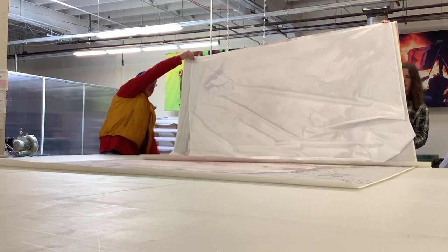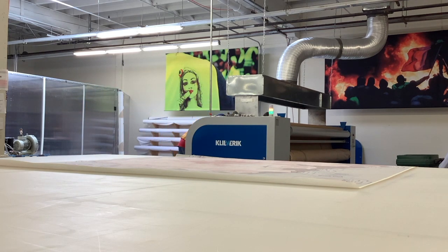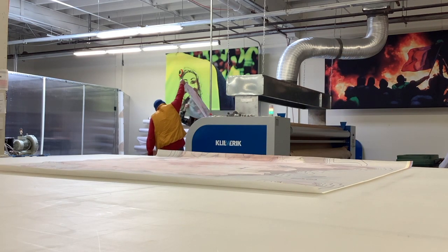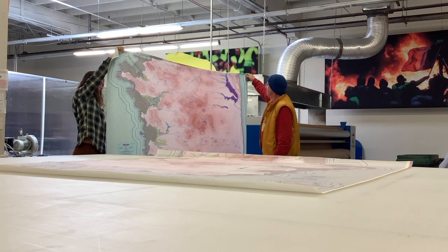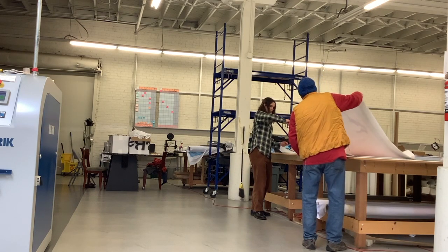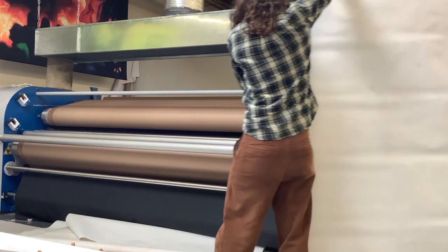Of course, if you expose it to extreme heat again, it'll look like it's fading the colors — actually dissipating the ink. This is the magic moment in the whole process. This is the dye sublimation itself. It takes a couple of minutes to go through this heater, and as long as it's pressed tightly together, the ink on the paper will only reach the fibers very closest, keeping the fine detail and creating this full rich color with amazing high resolution. And that high resolution detail is the whole point of putting it on a shower curtain. When I saw how little of the detail was available on the two-foot by two-foot posters I was making, I thought, people don't have enough space in their house for a giant blow-up. Oh wait, maybe they do on a shower curtain.